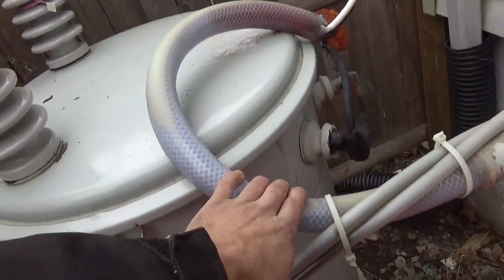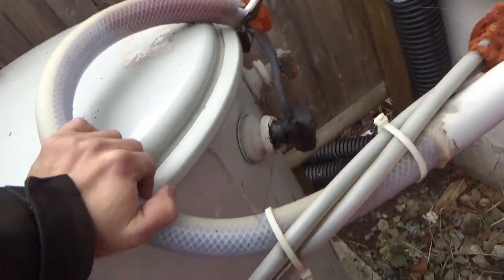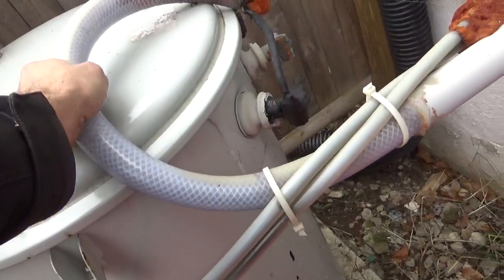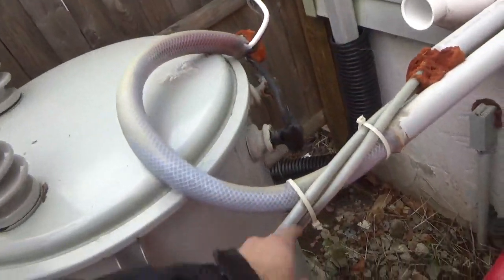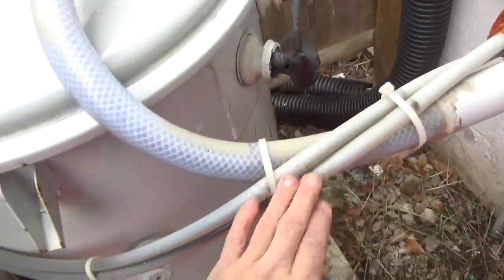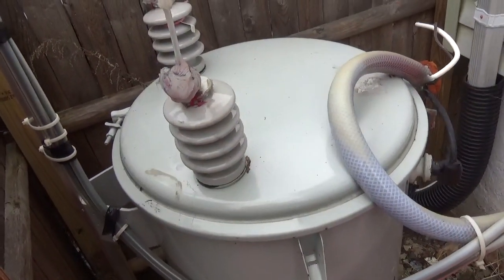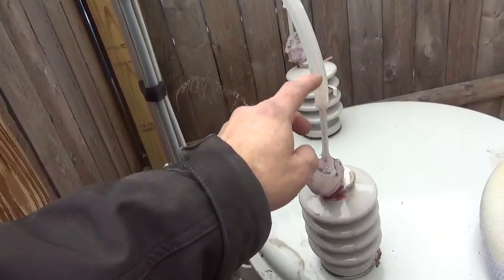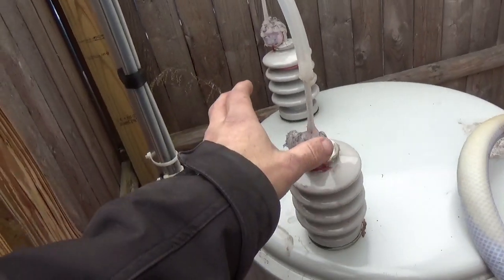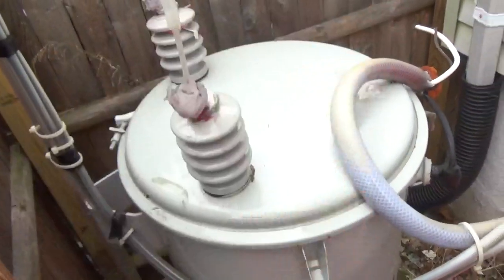This is number two service entrance wire, copper. It's getting disconnected — I already cut the ground connection, the center tap isn't used, I already took the tape off of it. The ground was connected to the can. I have the service entrance wire coming through the tubing here. It was connected, electrical taped and gooped up. For high voltage wire I used RG213U in the tubing. The shields are stripped back inside in the amplifier and they're connected to ground — the chassis and the amplifier. The shields are stripped back in the silicone tubing all the way back here, and everything's gooped up with pure silicone.